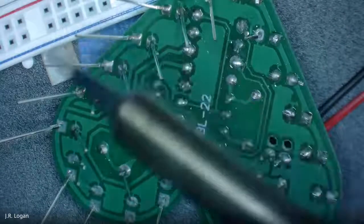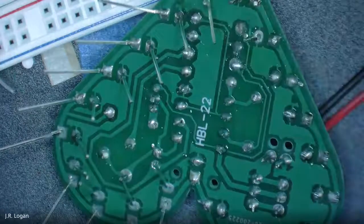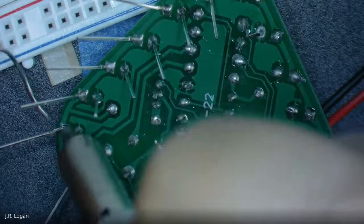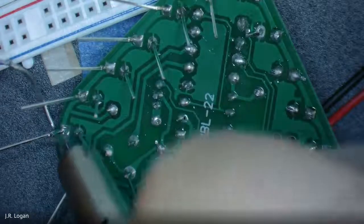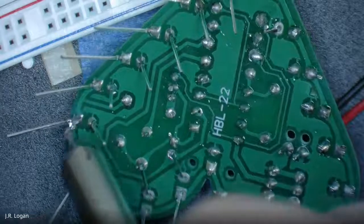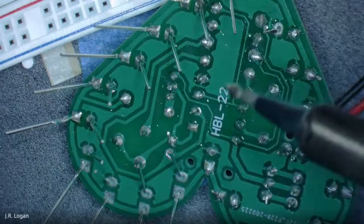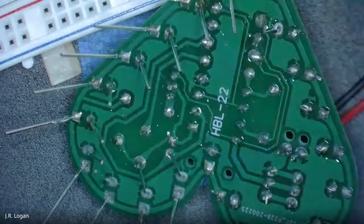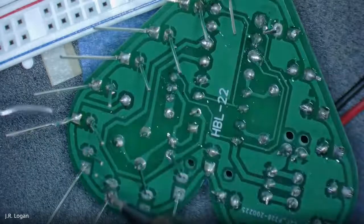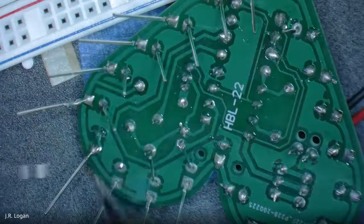Because there's a switch on the board. So I just taped both, and it doesn't really hold them close. So you kind of still have to squeeze it to get it to go. But the tape at least holds things in place. And I used the electrical tape that just came with the thing. Oh, and I meant to say the masking tape that I told you could be helpful, that was for when we were doing components on this board. If they start falling through, it didn't seem like anybody had trouble with that, but if they start falling through, you can tape them to the back rather than bending the pins outwards. And then you solder them and take the tape off. That's another little tip.